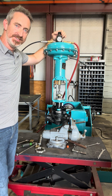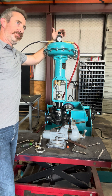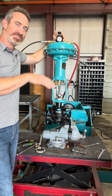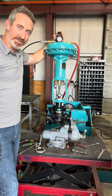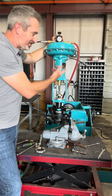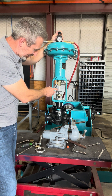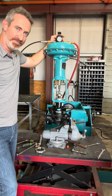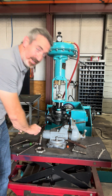There are times in the field where you wouldn't believe the scenarios — you've got four compressors running, they're getting out of ramp because you're down working on one, compressors are starting to surge, you don't want them to trip. You've got to get this thing going quick. The best thing to do: back your regulator down — if your bench set tag is 8 to 30, back your regulator down to 10. All you want to do is find a way to lift this just a little bit, about a quarter of an inch. If you could stroke it up just a quarter of an inch and hold, make your connection. A lot of times that's good enough for field work.